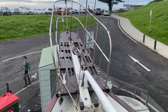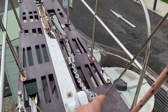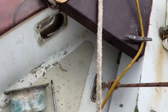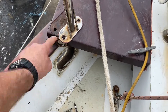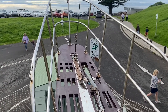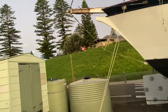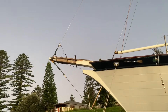I've got most of the bolts out - a lot of the stainless ones are just snapping. I just have to do these two over here. You take the fairing out and then there's a really long bolt that goes all the way down with a nut on it. I thought they'd just be coach screws into the teak but they go right through. We'll do that on the other side and then this will be ready to remove. Not much fun getting that platform off because it's got bolts going through every foot.